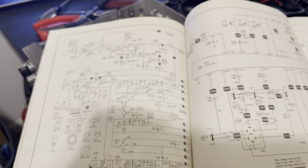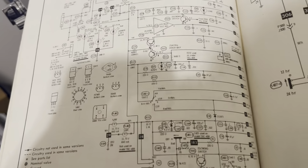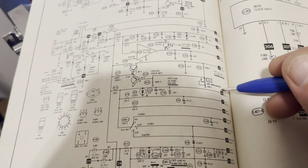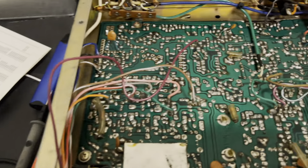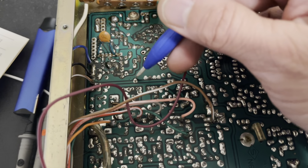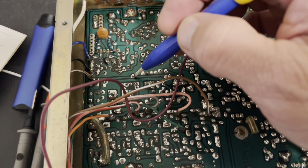Here we have the SAM's manual out for the TRC-457 and 458. I'll show you where I normally grab my 8 volts for the clarifier circuit once it's unlocked — right here. We're going to grab 7.82 volts off this power run, as noted in the SAM's manual. They number out these traces so you can more easily find them. This is the same rail I use on Cobra 138s or Realistic TRC-449s — a steady, constant 8 volts to the clarifier circuit, as opposed to the 8 volts it currently has only in receive. So it'll have 8 volts in both receive and transmit.